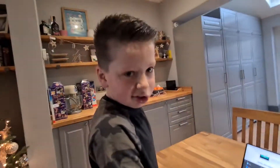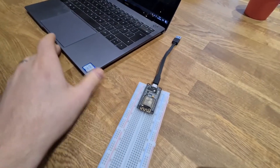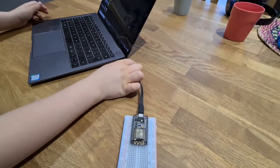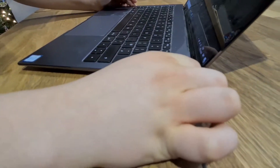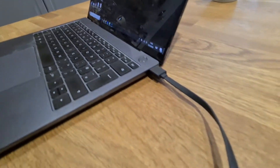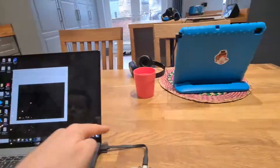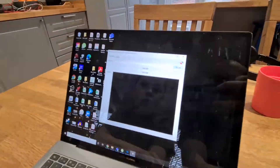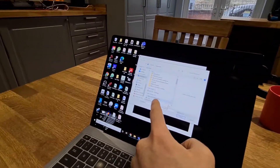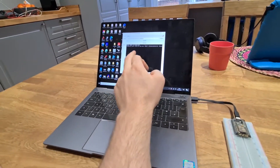Me and Oliver are just checking out what we're using here. I've got a laptop, the NodeMCU, just connected to a breadboard with the USB cable. Just talking Oliver through the steps. We're going to connect up the NodeMCU to the PC to start with. We're using ESP Home Flasher on the PC to flash the firmware onto the NodeMCU. We're just finding it here and we're going to load it across. I'll leave links down in the description with all the details of what we've used.